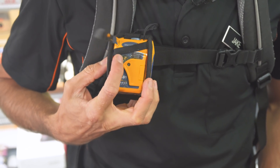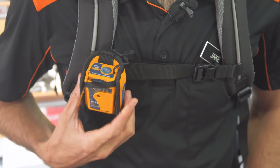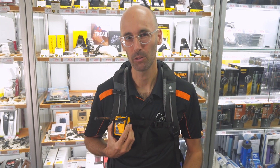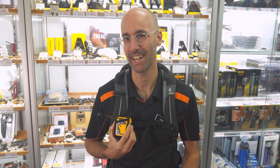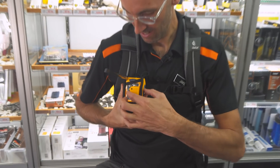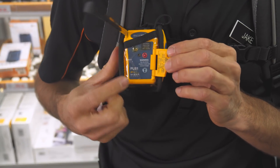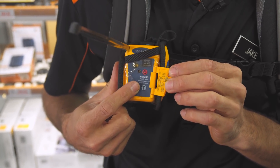It's got a bright flashing strobe and a minimum operation time of 24 hours. The Rescue Me PLB1 is a multiple-use device, so if you've used it, been rescued, and you're heading out again, you can use it again. But you do need to test it regularly — flip open the lid and hit the test button once a month for the battery and once a year for the GPS unit.